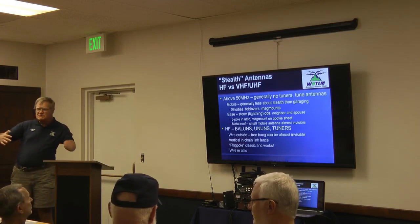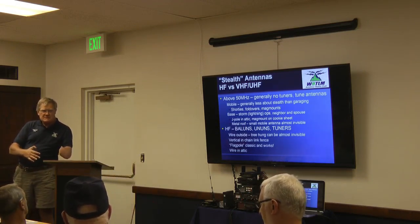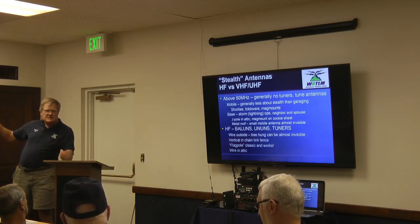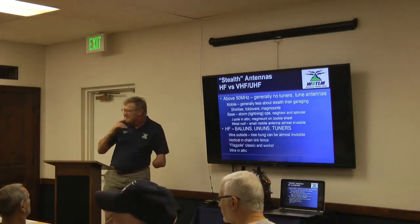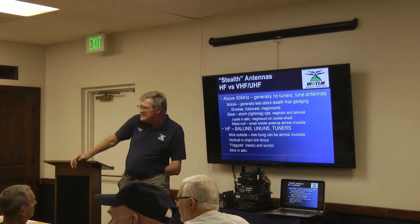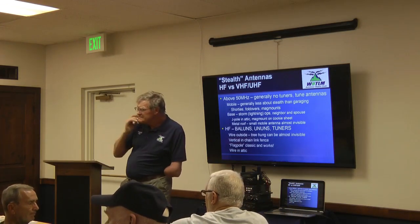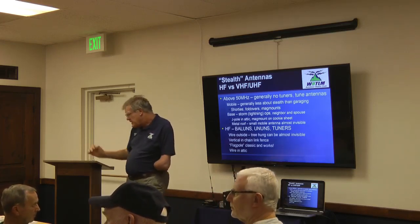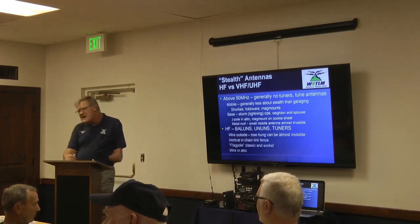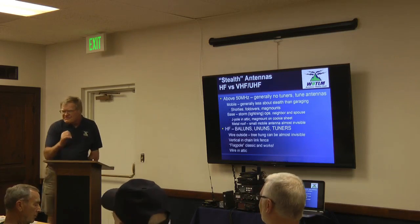There is a relationship between the size of whatever you stick it on and your effectiveness of the antenna that I don't think is critical. No. When I first moved down to Monument, I didn't have an antenna set up, but I did have a mag mount antenna. So I stuck it to the ductwork in the basement. It was upside down, but people could still understand me. Yeah, but VHF, it's kind of amazing what you can get away with.